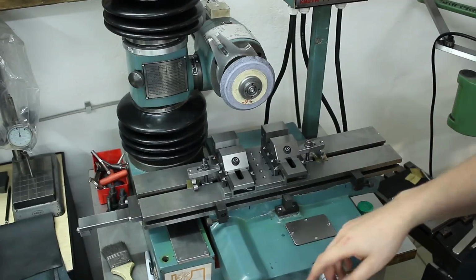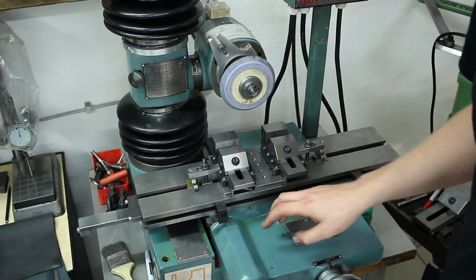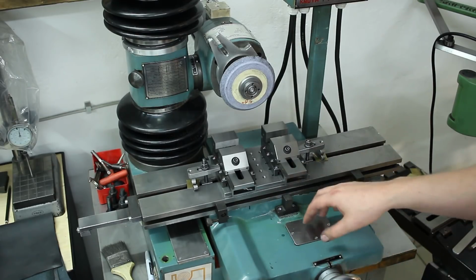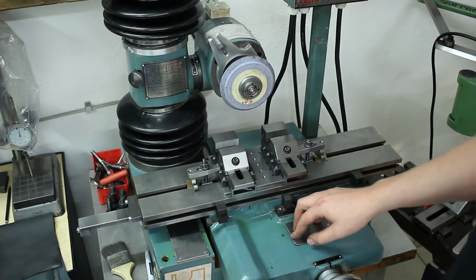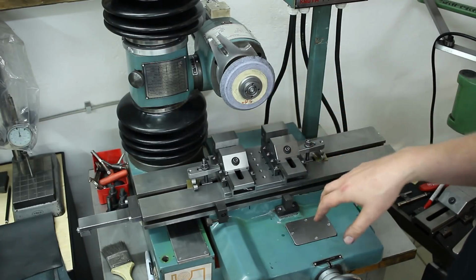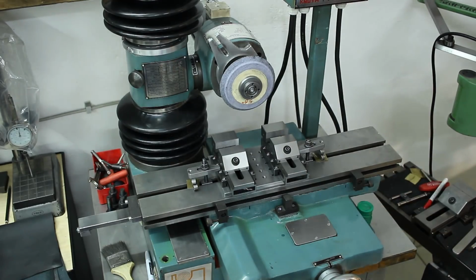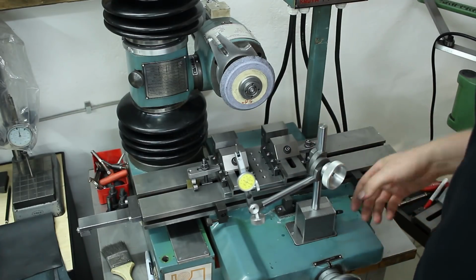That's very nice. I added 2 plates here and here that are screwed on. These are precision ground flat stock, because that's a problem with very many industrial machines too. They do not have any flat spots where you can stick a mag base to indicate your work or the accessories in. So I screwed these on, and they're a very nice resting point for the indicator stands.